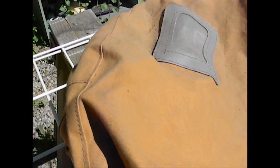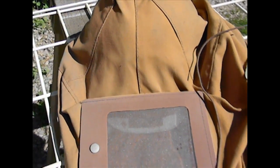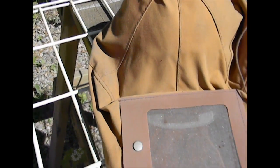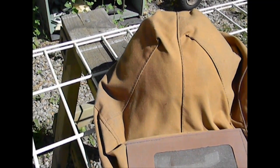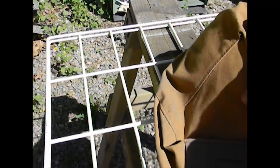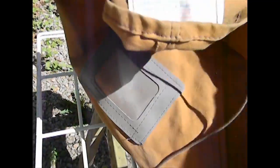On sandblasting cabinets, you have the option of hooking a vacuum, like a shop vac, to it to keep the dust down. Now this sand just coming out of the cabinet is pretty dusty because we've been using it for about a month. So there's a lot of particulate matter in here, a lot more dust than usual. But even so, when you're outside, it would help to wear some kind of a dust mask, or throw a bandana over your face or something. And you can also wear one of the bandanas or the do-rags, just soak it in water, and you can put it on under this.